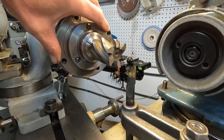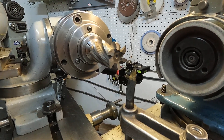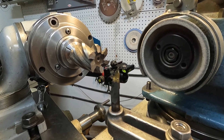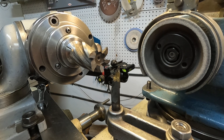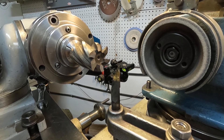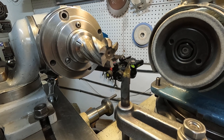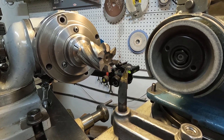The air bearing fixtures just kind of sit in place and have a tube that holds the cutter. I had one for a while and went ahead and sold it, because I found it just wasn't really economical for me to grind small end mills with that. You can actually grind quite small end mills in the regular workhead, but it can be quite a bit more delicate.